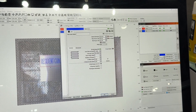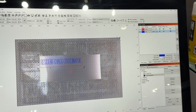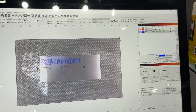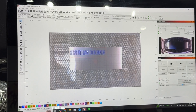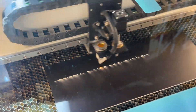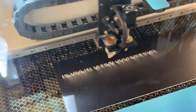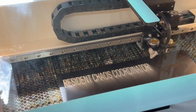Since this new nozzle is a lot better — I engraved a whole bunch of acrylic (not two-layer) with the air on and it turned out amazing with the new nozzle and LightBurn. I didn't measure the nameplate 100% — I measured the height at two inches and just put eight inches as the length, so you'll see it's like a quarter inch short on the ends. But basically it's just a square with the name or whatever you want in the middle. The acrylic dust is blowing all over the place, but it does look a lot cleaner than it did when I disconnected the air hose. The reason I didn't disconnect it this time is because with the new nozzle it's a little bit hard to reconnect, and it worked out pretty well.